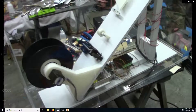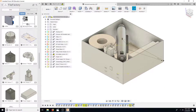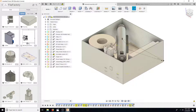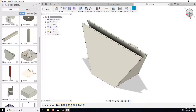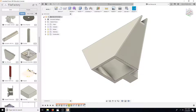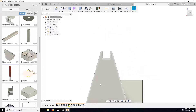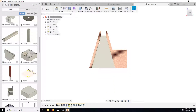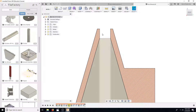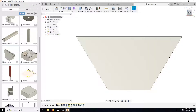We're at 20 minutes, so the last thing we'll do is electronics. First, the fan shroud — it's going to be a lot different but this is the concept I've been using, which I really like. I'm probably going to use a high-pressure, very quiet 40x40mm fan on here. It has a five-millimeter-plus gap. If you look at the section view, it goes here and funnels everything up into this small little hole. I think with my current fan I have about 15 mph wind coming right across this filament.